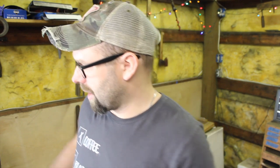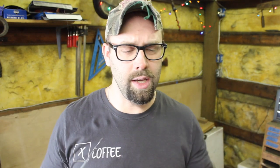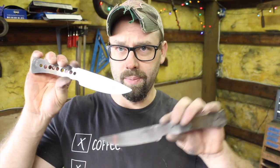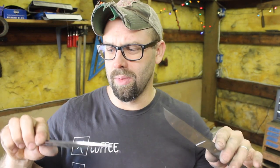What we are going to be using today is a couple of nice Damascus blades — 1095 and 15N20 steel, both from the same billet. This is a 294-layer billet. Obviously we lost a few in the production process as always, but that's how it started out. It's got some nice layers to it, and it's going to be a lot of fun to see what it's going to look like. I already know because I kind of did a test etch, but you guys will enjoy that, I think.